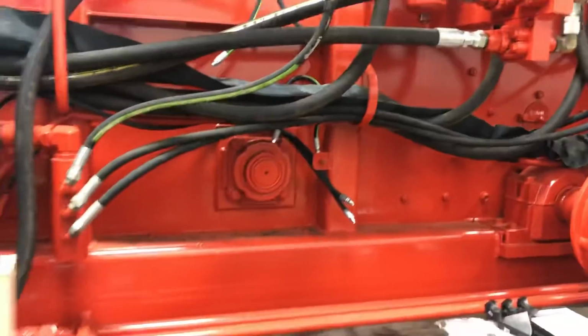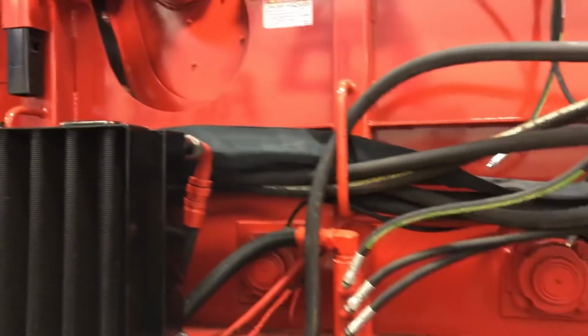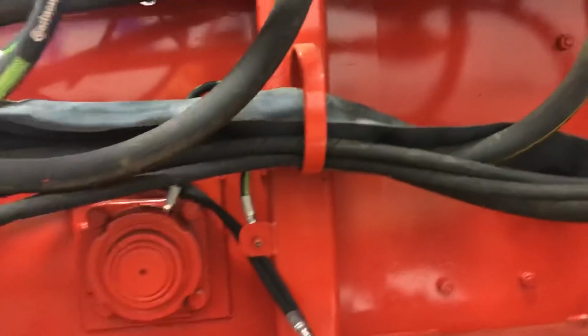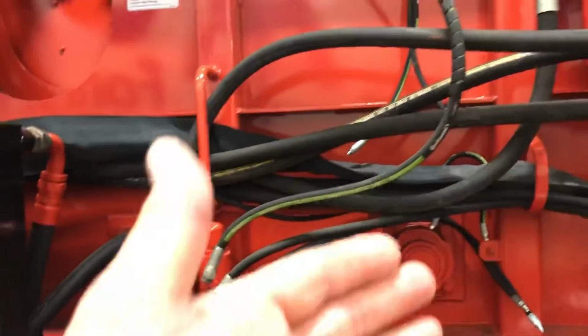And then what I did is you got three feed wheels. This is called your out feed. That's called your in feed. Once it goes through the flails, it's coming out in the chipper disc. Chipper knowledge. But instead of them all having grease zerks on them, every feed wheel, there's one more back here, the last one. So we run grease hoses all the way back to here, and we'll pop two more of these out right here. So we actually have five right there. That'll be your front, that bearing, that bearing, those three bearings.